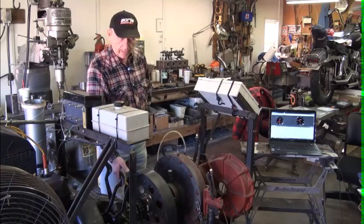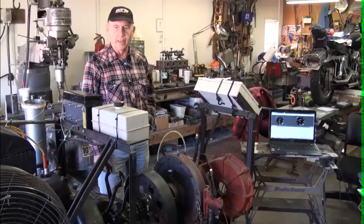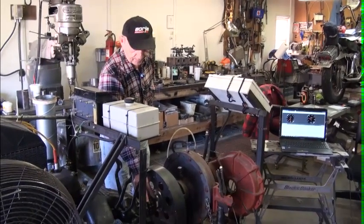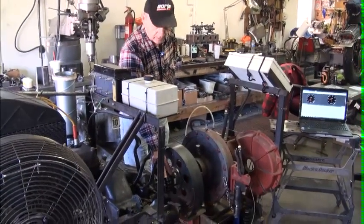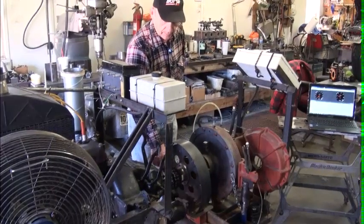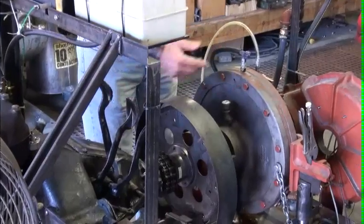The chain coupling was just an industrial strength chain coupling that we came up with — double chain — that we can run up to, I think they said 60 thousandths out of alignment and it's still pretty happy. We strive to get it much closer than that, but we coupled the Model T directly at engine RPM right straight through to the dynamometer.